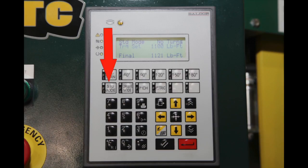Other keys on the panel are Standard Mode, High Torque Mode, Inch, and Metric. Each of these buttons, when pressed, sets the machine in an operating mode that corresponds to the button label. The operator's display clearly indicates the operating mode in which the wrench is set. In the case of the Inch and Metric buttons, the unit of torque measurement can be changed from inch units to metric units by simply pressing the Metric button. To select English units, simply press the Inch button.